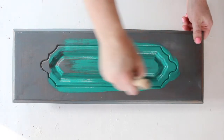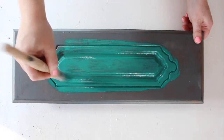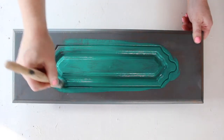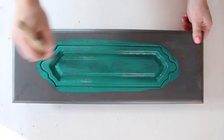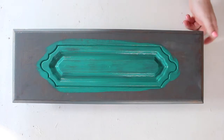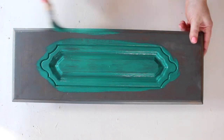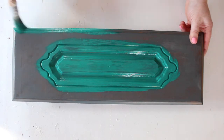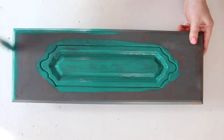So if I went in with a white primer here and I was going in with this teal that's really, really deep, I probably need more coats of paint. So usually when you're painting, you need two coats, and you might need a little top up coat as well, just in certain areas. But that really depends on the colour that you've picked. Some of the high pigment colours are harder for coverage, like yellow and red.